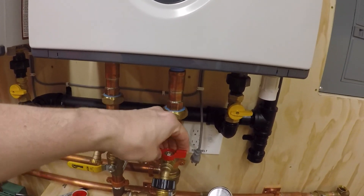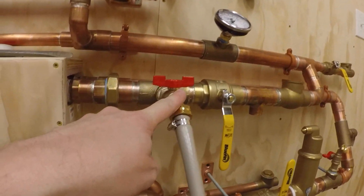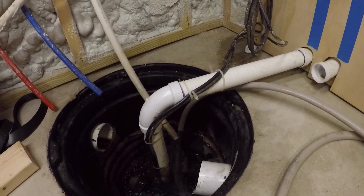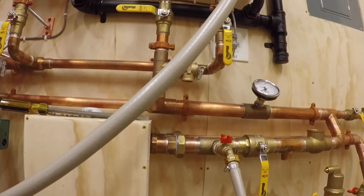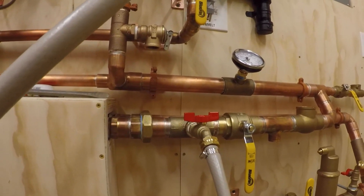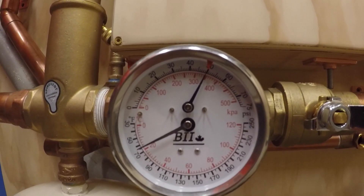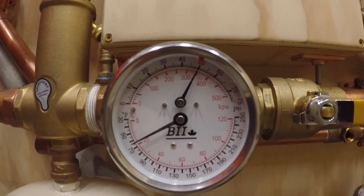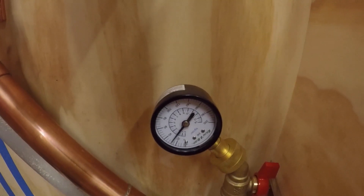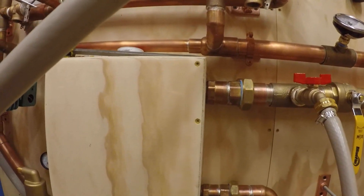As you can see right now, this is on — I'm bringing my water in here, it's full all the way down, up, and then here is where I cracked this so I could put this on full. It's filling the heat exchanger and coming out here. With that off, I'm at 50 psi on the domestic side, and I'm holding just under 30 on the heating side. No leaks — I'm happy with that, that's my street pressure.